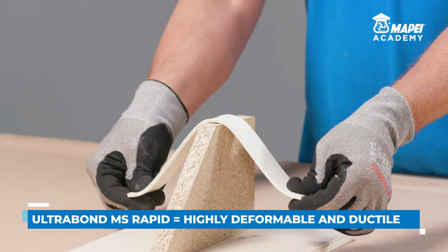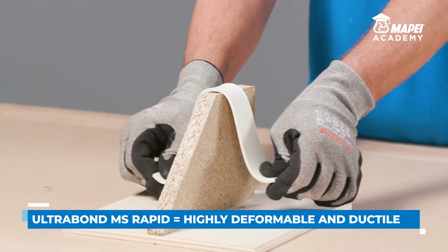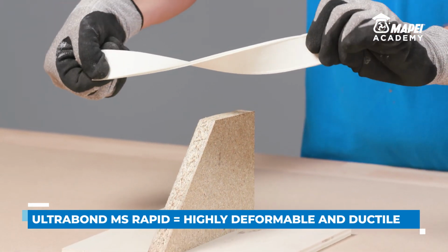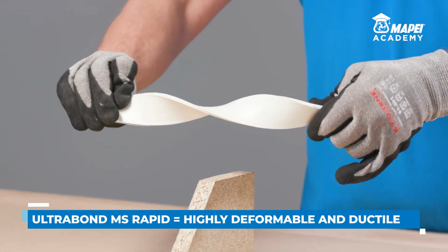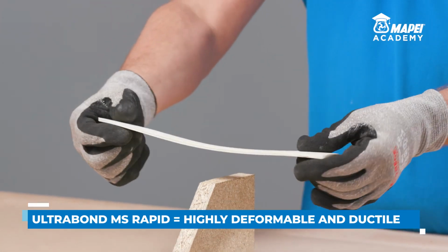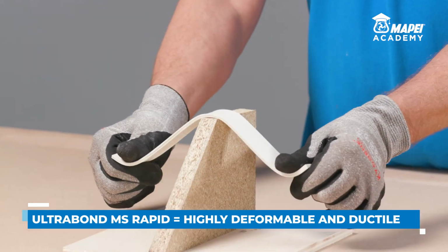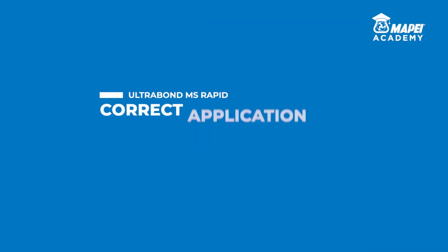Ultrabond MS Rapid assembly adhesive, however, is highly deformable and exhibits ductile failure. Thanks to its level of deformability, Ultrabond MS Rapid adhesive allows you to bond different materials with different behavior, compensating for their different thermal deformation without the risk of brittle failure, which would lead to sudden detachment.